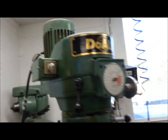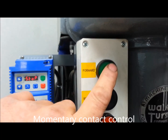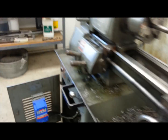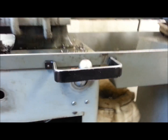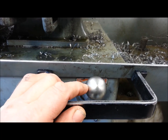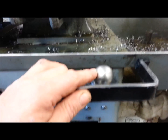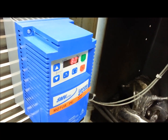That's great for tapping — if you're doing power tapping and things like that. These are momentary push buttons. This one is on a maintained-type control using the factory drum switch. It's a three-pole drum switch but I'm only using one of the poles to activate the VFD. When I flip that switch, that's what sends the signal up to the drive.